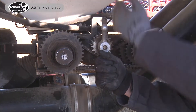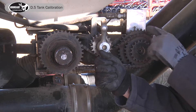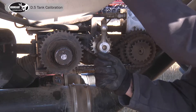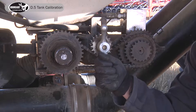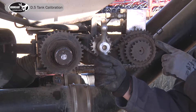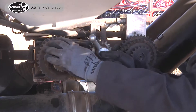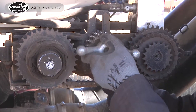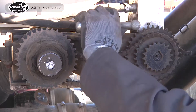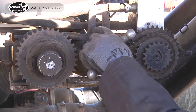This is tank one — we have three ranges: high, medium, and low. There is a decal along the side telling you which is which, and our chart showed us that medium would be best. We are in fact already in medium. If we needed to move it, we just loosen the wing nut, move it to the appropriate range — no need to change chains — then slide it back down with a bit of tension and tighten it up.